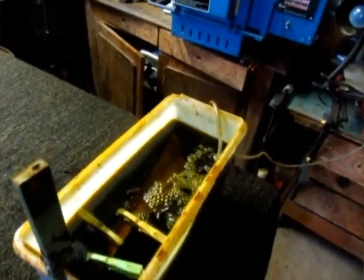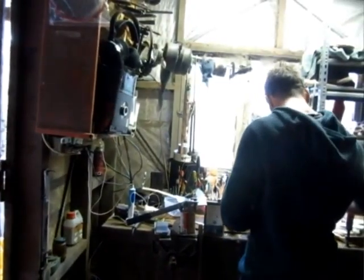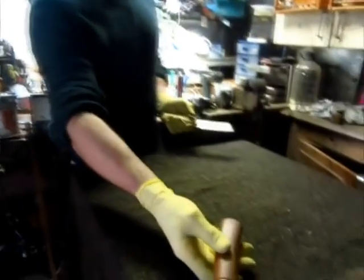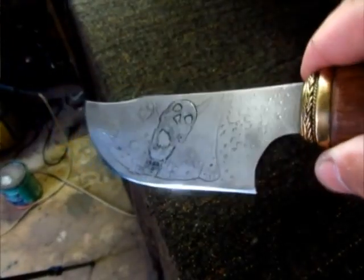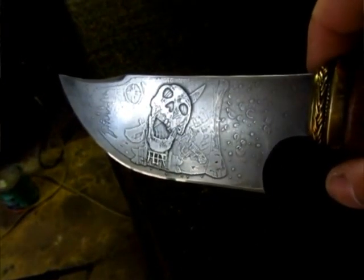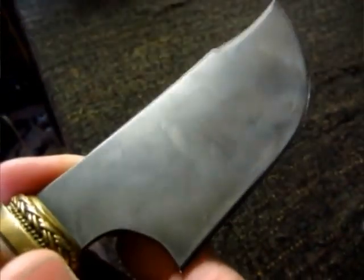On one of my blades, you can see, that's the first one I made using that technique. You can clearly see on this blade, when you put it in the light, that you get all this. That's what the bubbles caused. I did actually like it. I even went over with the bitumen paint to raise them a bit more. But they were already there, caused by the bubbles because I had the blade at the bottom of the tank.